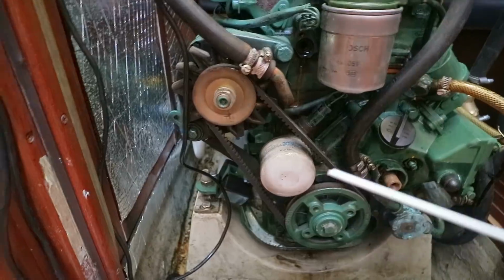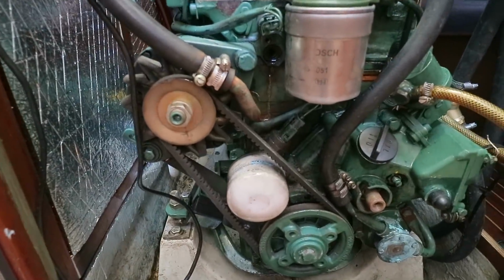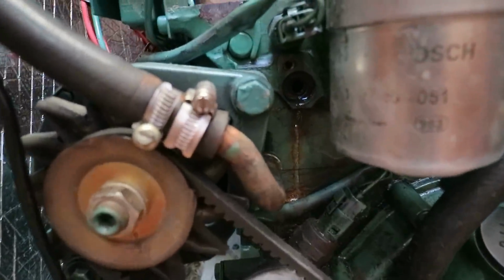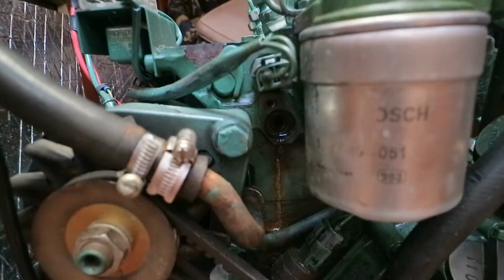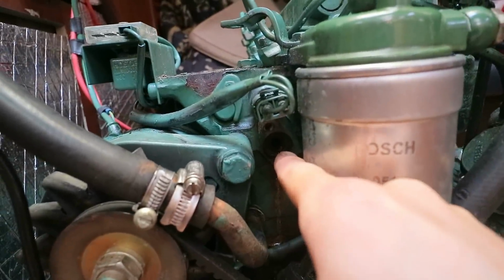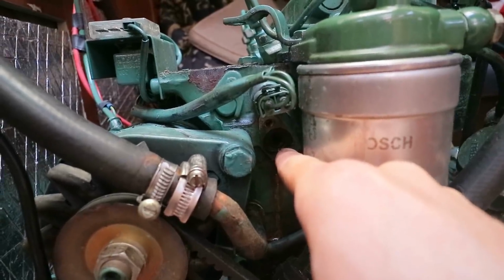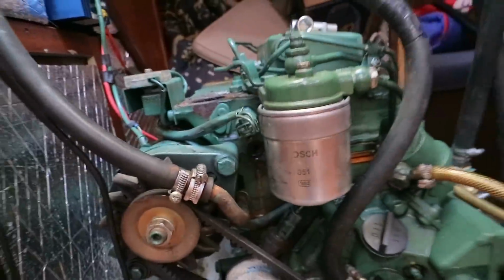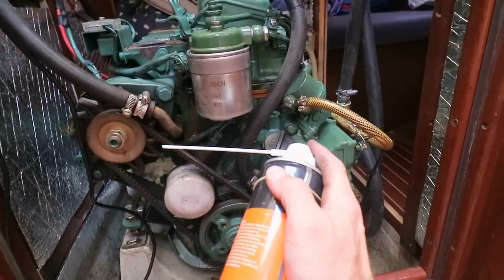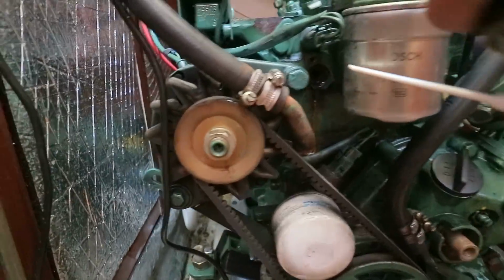If you spin it upside down, you get a very, very cold liquid coming out, and you can use that to cool things. So I'm going to try and cool down this water distribution pipe so much that it contracts a little bit, and see if that will help me free it up and hammer it out through the other side. This stuff works really well. You could actually quite easily give yourself frostbite if you sprayed your finger. So it is quite a powerful way of cooling things down.